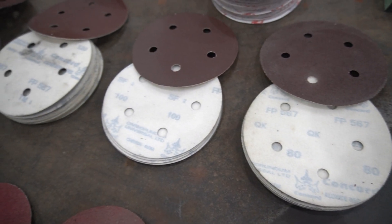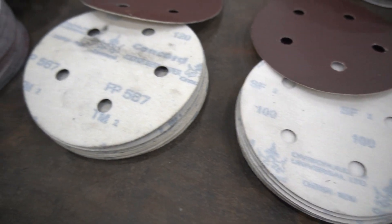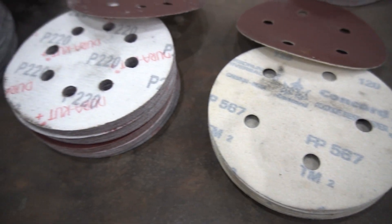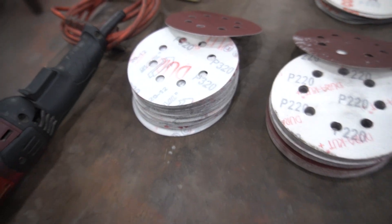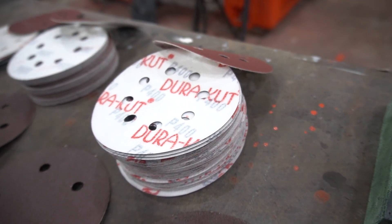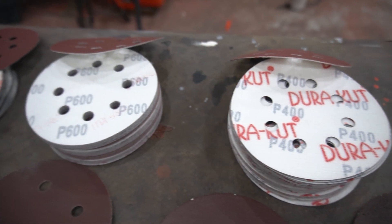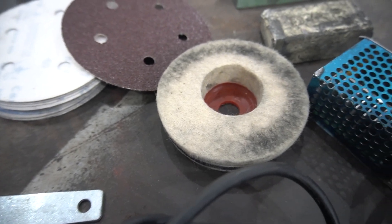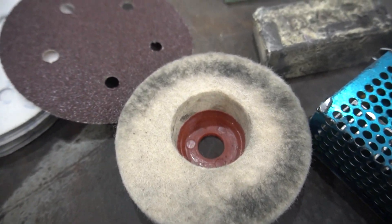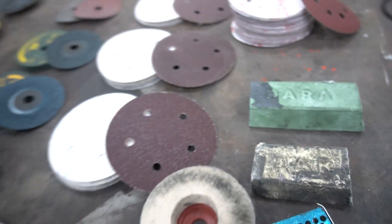In the third and fourth rows we have aluminium oxide velcro pads. The grit size of these pads starts from 60 grit and goes up to 800, though they also come in much finer grits up to 10,000 grit. In our case, 600 grit is fine enough to attain mirror polish. Along with this we have a felt wheel — a four inch angle grinder felt pad — which we use for buffing with some buffing compound.